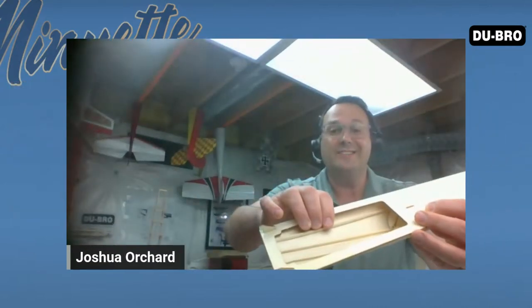Okay. So really what you have to remember is that you're doing this essentially one half at a time, right? So you cover the whole thing, but you spray the Windex on the outside of the wood so that it will bend and then you'll have the dry portion on the underside. And that way I like to tack it in position with CA glue. Okay. Right. And then on the bottom side, if you can see, you go in with your glue and you can do proper gluing on the seams from the inside.